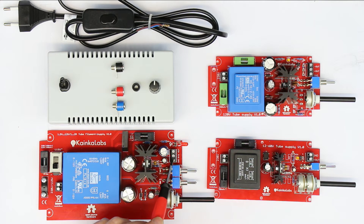We have an additional output which is called grid, and that one is an unstabilized output, but nevertheless filtered with an RC combination with 1000 microfarads and 100 ohms, so you get a clean negative grid voltage. This filament power supply has a double purpose because usually in tube experiments you need three voltages: one for the heater or for the filament, a negative voltage for the grid, and a positive voltage for the anode.